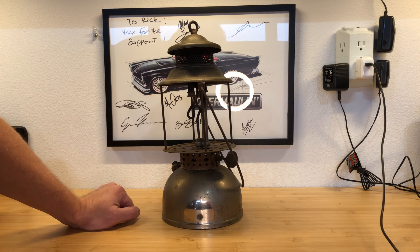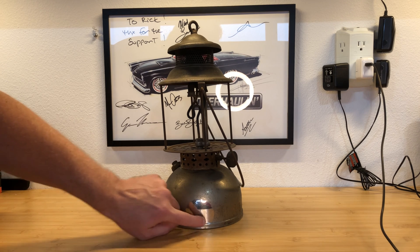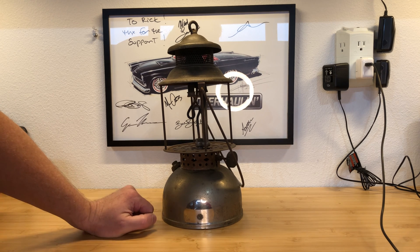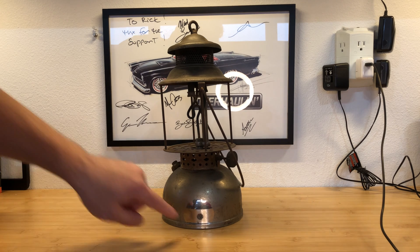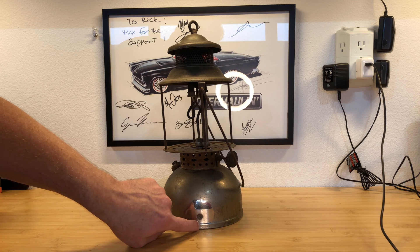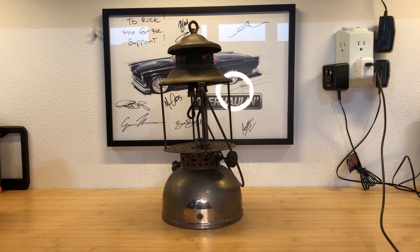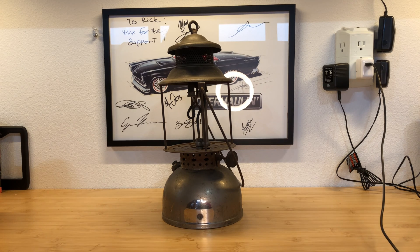I was just curious to see what happened. If I'd left it on longer it would have eaten through all of this corrosion. My guess is that when this was in storage for a long time, it was touching something that had an electrolytic reaction that ate through the nickel and left the brass exposed. And of course brass over time gets crusty. What looked like a stress crack completely disappeared — it was apparently just some discoloring in all of this buildup. What I thought was maybe a pinhole is just a spot of exposed brass, and there are no bubbles, so that's good.